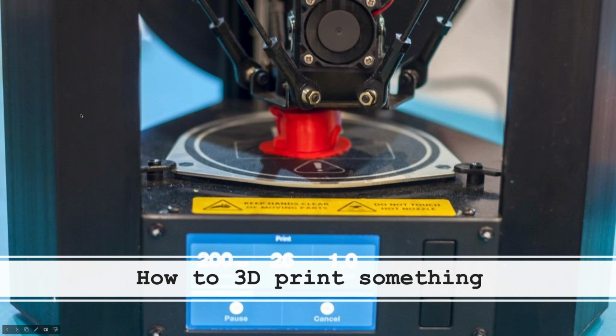Okay, so once you get your 3D file, you're going to go into the slicer and adjust some settings. Nowadays, printers usually come with presets, and most popular slicers like Cura and PrusaSlicer have presets for most popular printers. So you just get a good brand of filament. This is one recommendation. Get a good brand of filament, because otherwise you're just going to get cheap filament that's probably old, and by old I mean it's been sitting in a warehouse for a long time, and what happens is humidity, the water in the air, can ruin the filament and make it brittle and turn it into trash. So just make sure you get a good brand of filament, and always make sure your filament is dry.